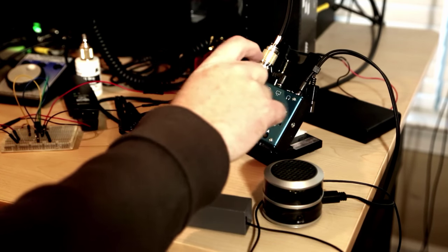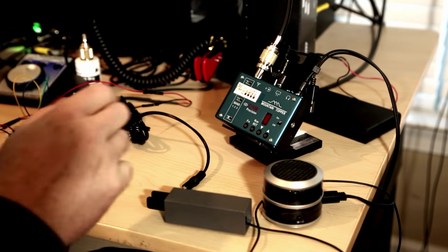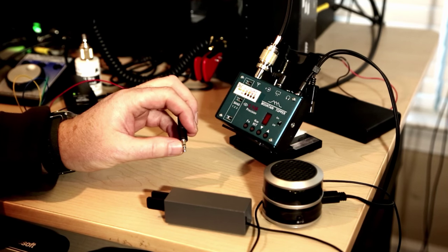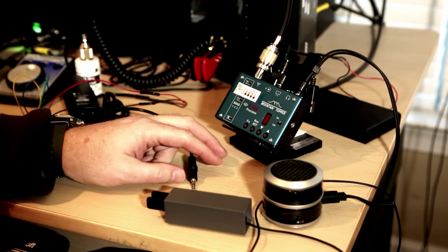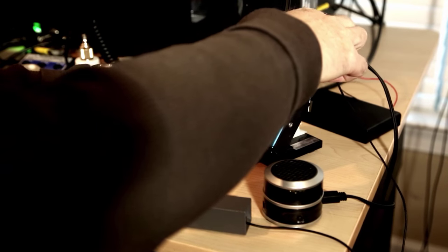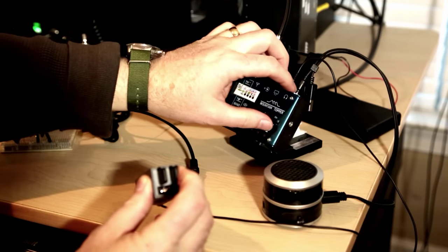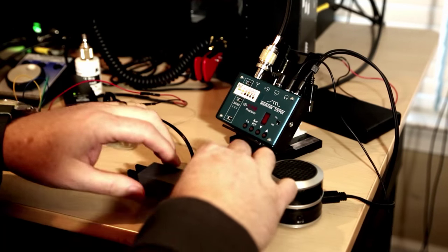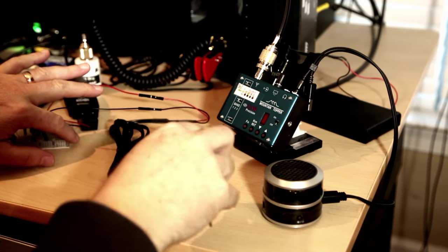Let's try this with my Mountain Topper, my little tiny QRP radio that I just recently got. Now the Mountain Topper takes a 3.5 millimeter plug. However, unless you plug in a mono version of this, it's going to think that you have a paddle attached and we need the radio to think that it's got a straight key attached. So the way we work around that with the Mountain Topper is: if you plug in a paddle and then hold the dash paddle closed while you turn it on, now it thinks that it's got a straight key attached when it really doesn't.